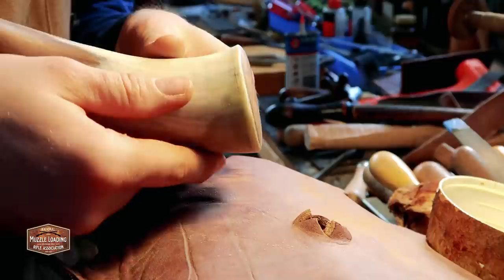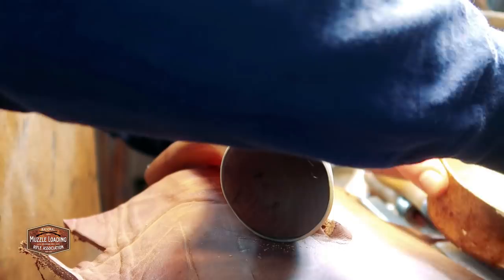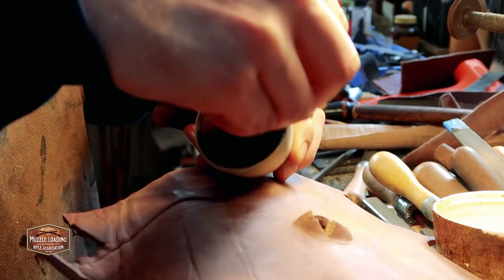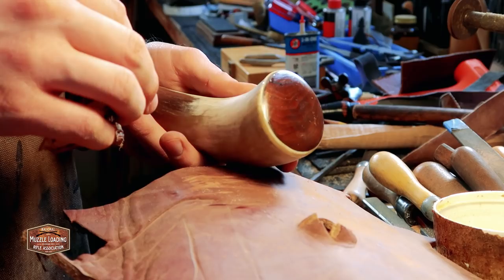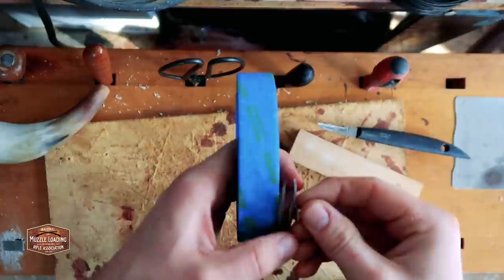There you can see the finished dome on this horn plug — it's not perfect but good enough to move on. To get an idea of what the finished plug is going to look like, I'm adding a little natural Danish oil just to bring out the curl on this walnut for a sneak peek. If at this point you still see file marks or sandpaper scratches, wipe the oil off and get back in there with your sandpaper — we don't want any geometric file marks or obvious sandpaper scratches to be visible, so take it back and sand again.